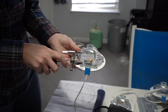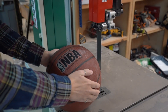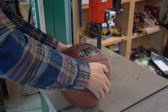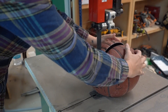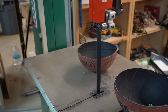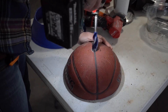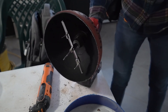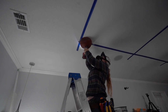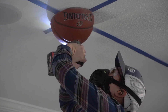Before getting after it, I next made a dust shield. Drilling into drywall above your head is going to create a huge mess. They do make plastic shields, but I didn't pick one up. So instead, I grabbed an old basketball and cut it in half. After drilling a hole in the bottom, I could poke my drill through and grab onto the hole cutting tool. Now when I cut into the ceiling, most of the dust will be captured in the bowl instead of going all over the house. Drywall is still nasty stuff, so you can see I'm still wearing a respirator.